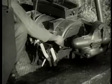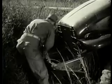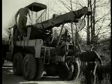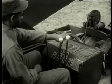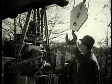In the meantime, a chain sling has been attached to the disabled vehicle. Movement of the boom is controlled from the crane cab. Push the hoist control lever forward to lower the hook so that it can be disengaged from the bridle.